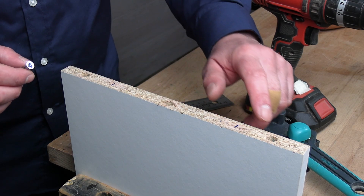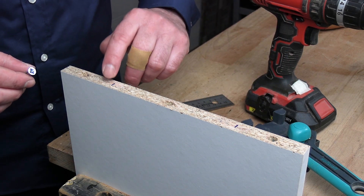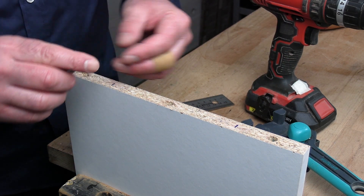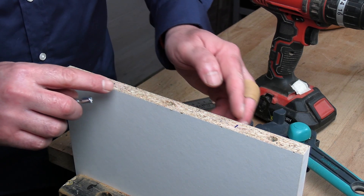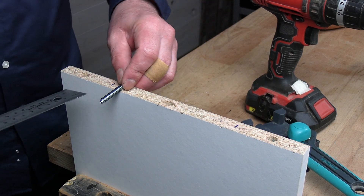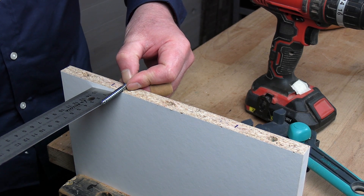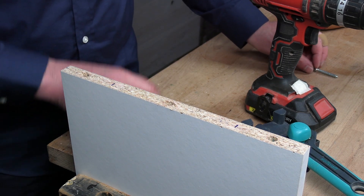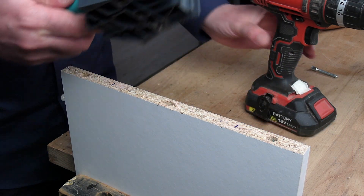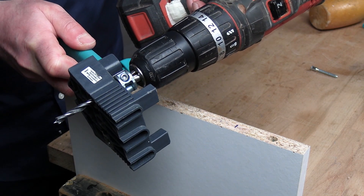Let's suppose I did not insert the wooden dowels — I had to remove them. And these are the marks where I want to place the screws. I don't want the screws too close to the center, nor too close to the ends of the panel. I measure how far the screw needs to go into the edge grain, and I adjusted the drill bit stop to make slightly deeper holes. I'm going to use the 6-millimeter hole.